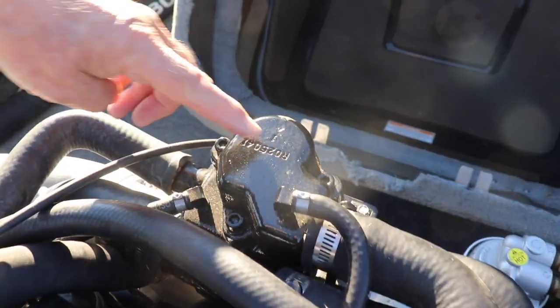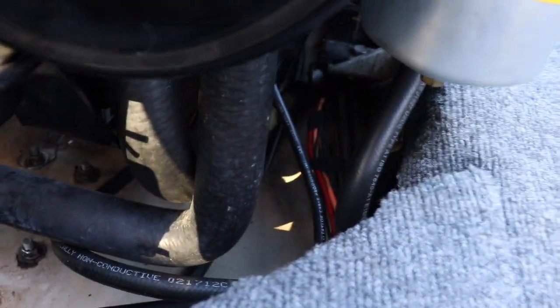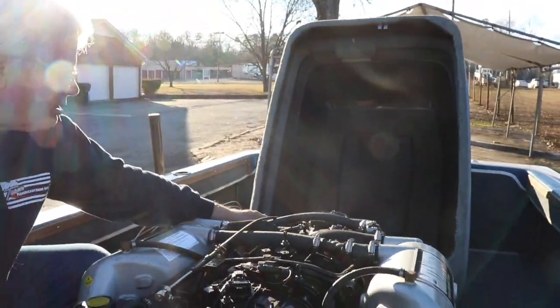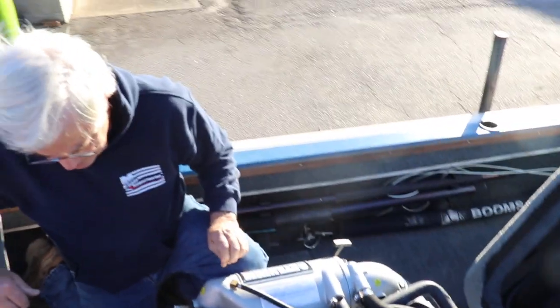As you come forward, your thermostat housing is going to be here. I like to pull the main hose off the thermostat housing. On the front there's a hose that goes to the transmission cooler and to the oil cooler — you want to make sure those hoses are pulled. We did take the cowling off the front of the engine so we could get to all these hoses. Make sure all the coolers are drained, the main thermostat hoses are drained. We also took this hose off which goes to the exhaust manifolds — make sure that housing is drained out. Once you get all that drained out, you're good for winter.